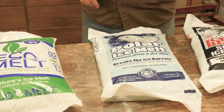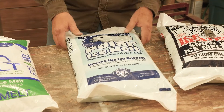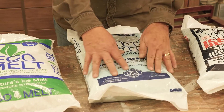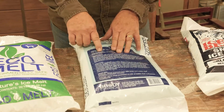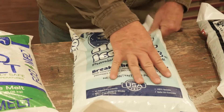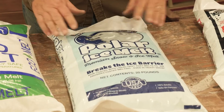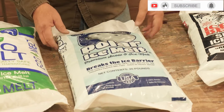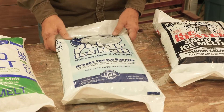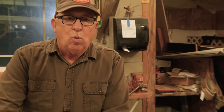Let's go over here to this one as well. This is Polar Ice Melt. It's very similar to Eco Melt in that it has the same granule size and also contains magnesium chloride. So what's the difference? Well, this has colorant in it — you can kind of see it through the bag; it's slightly blue. We like to call it Brody Blue because this is manufactured by Brody Chemical. Why is the color important? It allows you to know where you've already applied the product so you don't double apply, over apply, or under apply. It's pretty hard to see white product on white ice or white snow.